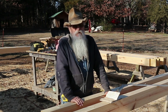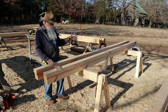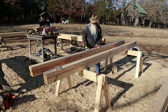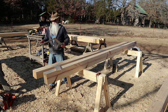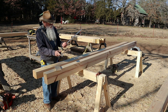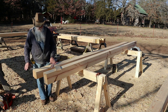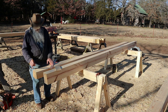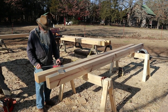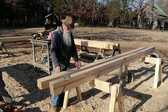The tail is the part that hangs over the end of the top plate. Some people have stayed with the old rule of using a framing square. I'm just going to slide this back a little bit and turn it over. I have these buttons on here — it's what I use when I'm doing a stairway. I've got it set on 12 on the short leg and 12 on the long leg, and it lets me just slide that up there. I'm making just a little mark here and stepping that off.